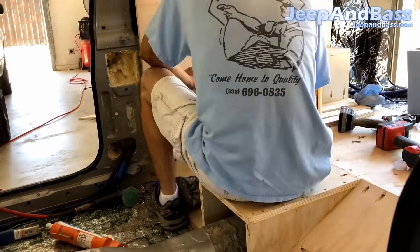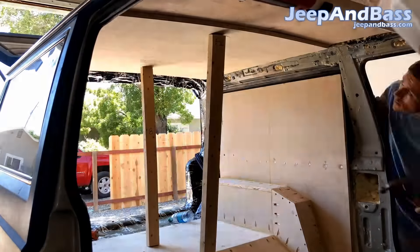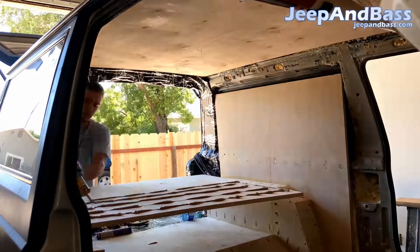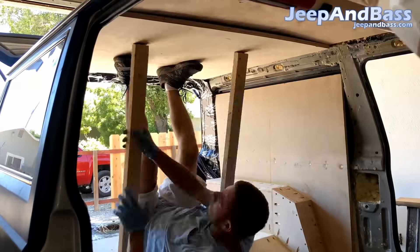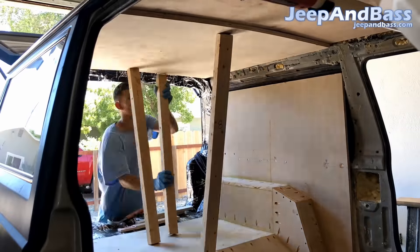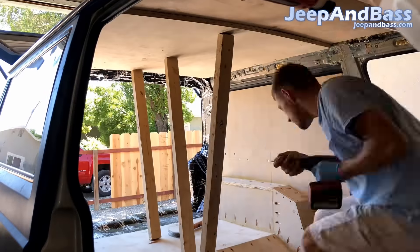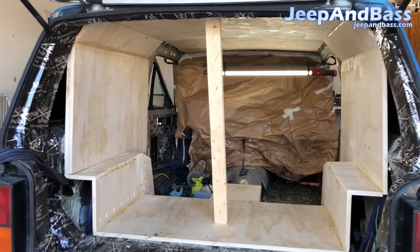Installing the roof was a lot of fun. That's the first layer going in for the box. I'm using some of that 3X construction adhesive and then we prop it up — I had to do some adjusting to make it work right. But once it's all in there it's got kind of a curve to the roof, and then we adjusted and screwed it down. We let it sit for about a day or two and then came back.